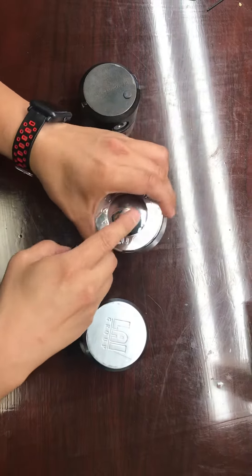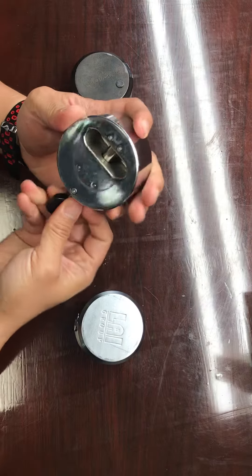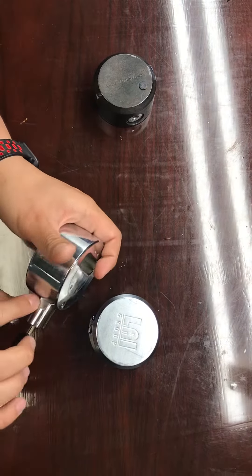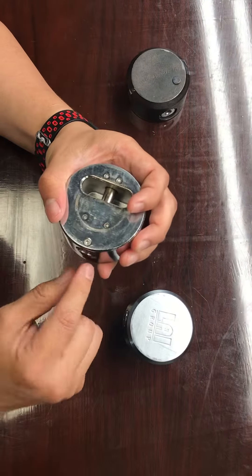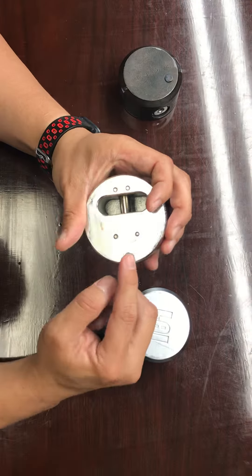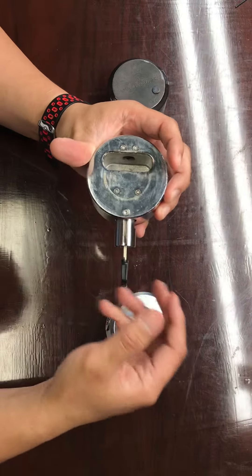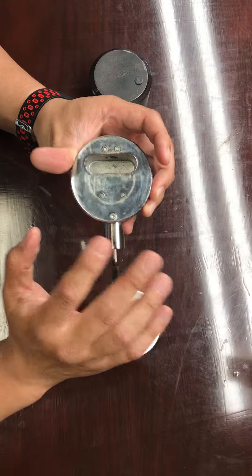With this last one, there's a bump on top that prevents drilling. But also in the back, you can see there are two pins that look like they're not doing anything, but they actually hold the two slots so that even in the locked state, if someone gets a grip and tries to twist it, there are two more pins preventing the lock from turning and therefore opening. So even if it's made with the same key, there are still a lot of minor details you should look for when choosing a better lock.